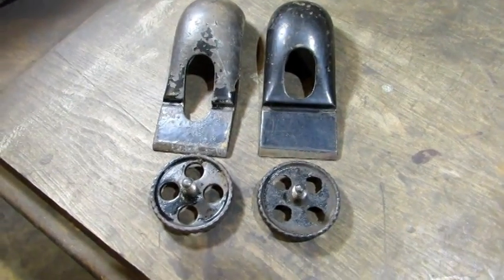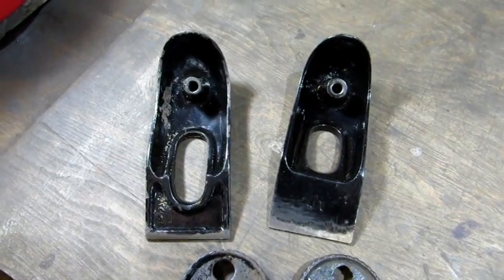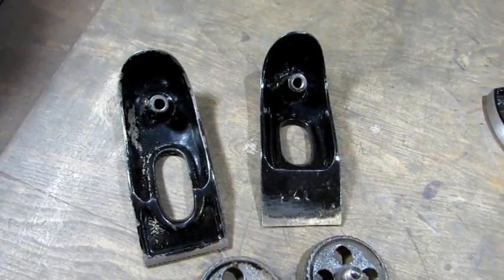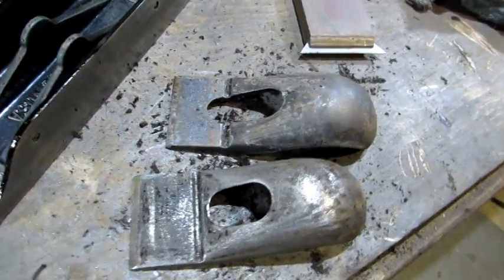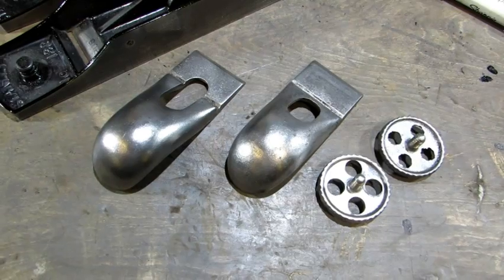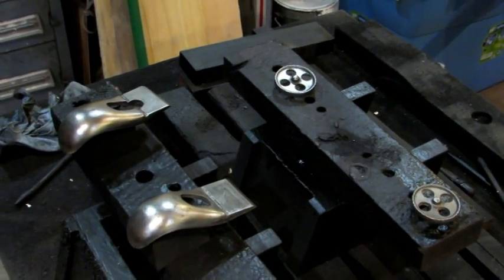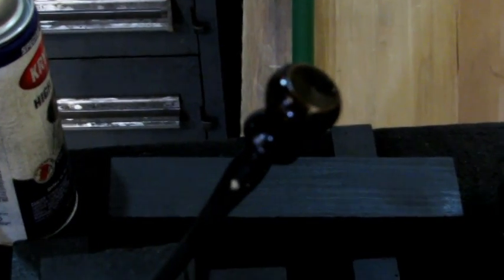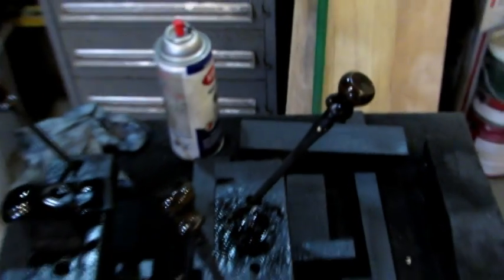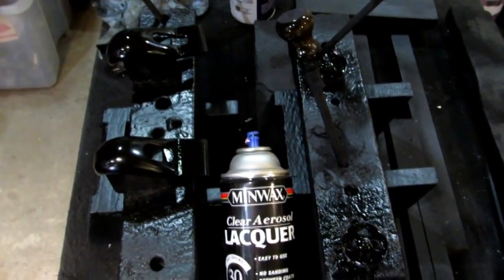Now I'm going to scrape and sandblast the old finish off of these. I don't want to use my favorite stripper because she's very expensive and I don't want to ruin the Japanning on the underside. Scraped and ready for the sandblaster. Caps are blasted, wire-wheeled, and ready for paint — and for that there's no place better than my oh-shucks-approved paint booth. Apply the first coat of paint. I spun-sanded the knobs and steel-wooled them and applied two coats of lacquer so far, and two coats of the finish on the caps.